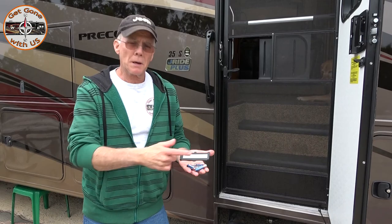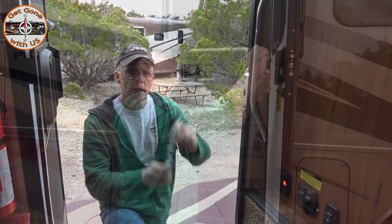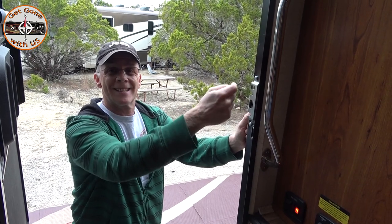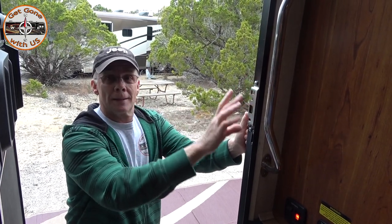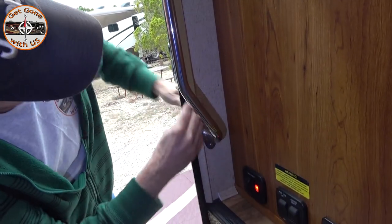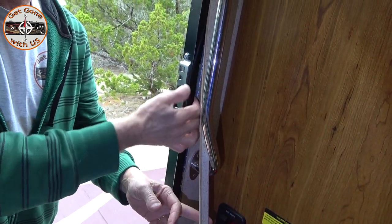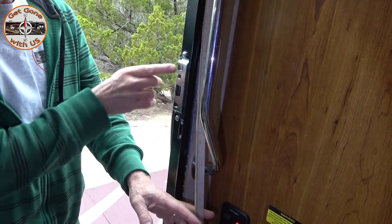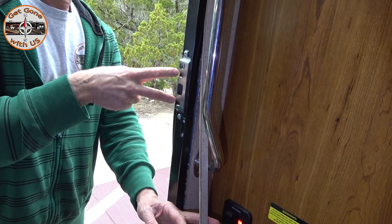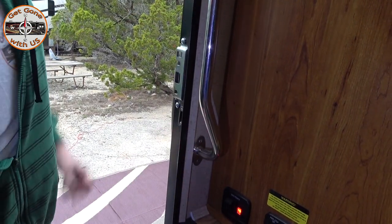To change the personal code a second time you have to pull the battery so that it forgets, because we wouldn't want it to be too easy to change. I'm just gonna put them back in and redo it. It comes with a new strike plate too, which is right here. But ours is actually lined up perfectly, so we took the screws that came with it - because they have thread sealant on them - and put it in to keep it nice and tight. The door's closing perfectly. If you want to change yours out, you have to come around the edge, pry out the piece Jayco glued in, unscrew it, pull it out, and slip the new one back in from behind. But chances are if you already have this kind of strike plate, you'll be all set. If you don't, it comes with one.